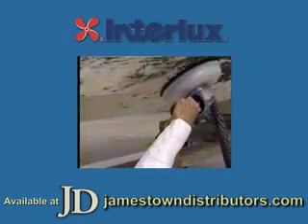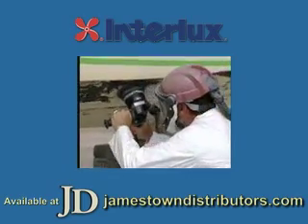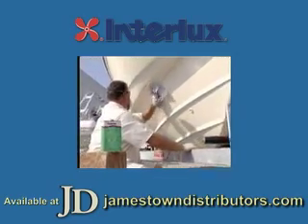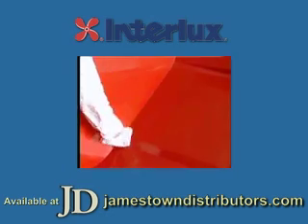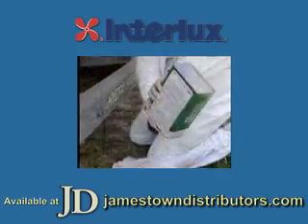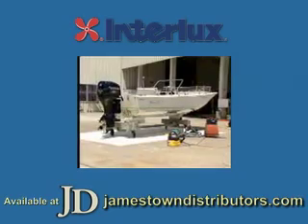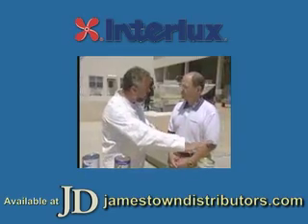Let's talk about what we've already done. We've gone ahead and sanded the boat with 60 grit sandpaper and got all the anti-foulant paint removed. If it's a brand new boat that you want to protect, you need to de-wax the gel coat. Remember, the first step the boat manufacturer uses is a mold-release wax inside their molds, and then they spray in the gel coat. That wax gets permeated into the gel coat, and if you don't de-wax it, nothing's going to stick. Our boat is from 1980 - it's already been de-waxed and bottom painted many, many times. So we're ready to start applying the Interprotect.